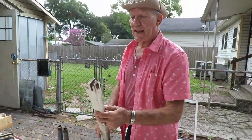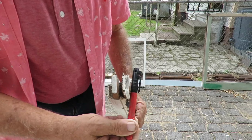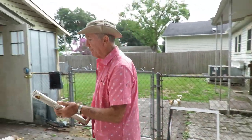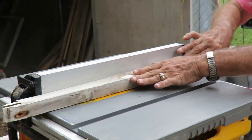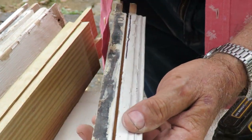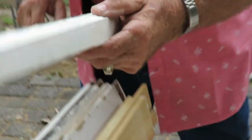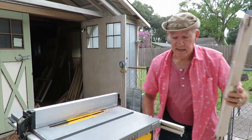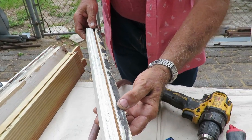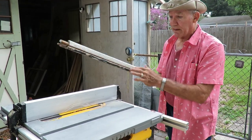What I'm going to do is run that through the table saw. One side has a bit of an angle — about 12 or 15 degrees — and the other side is square. I'm going to run this square edge up against the guide of the saw. I've made my first cut; you can see it's a little narrow. They used a thinner glass back in the day than what's readily available today, so I need to widen this. I'm going to move the guide and make one more pass — make sure you move the guide the right way so you don't cut into the molding portion.